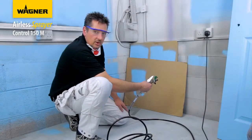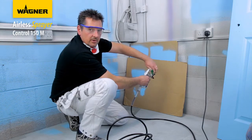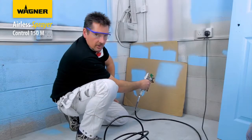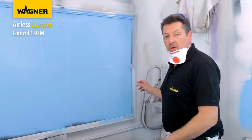Should you get a blockage, no specialist tools are required. Simply turn away into an empty bucket or piece of cardboard, reverse the tip, then return to your original position and carry on spraying. If you've masked up the skirting, this is the type of straight line you can achieve.